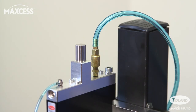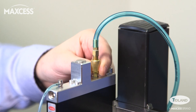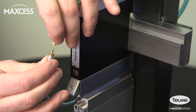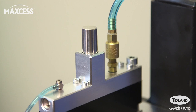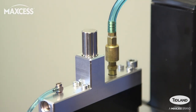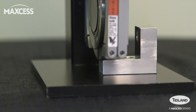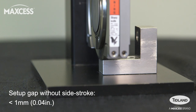You can operate the downstroke and side stroke using the slider valve on top of the knife holder. For faster setup, you may want to disconnect the cartridge air hose from the knife holder to only engage the downstroke. You can also manually push down on the depth control rod to extend the knife holder. With the side stroke disconnected, engage the downstroke, then move the knife holder so that the blade is less than one millimeter away from the bottom knife anvil ring but not touching.